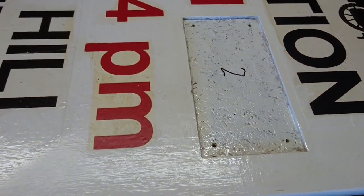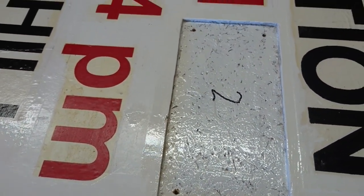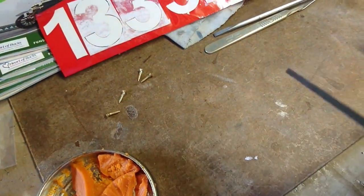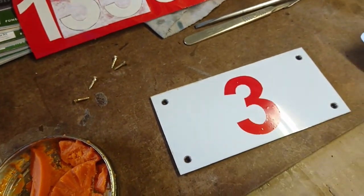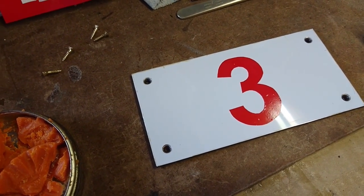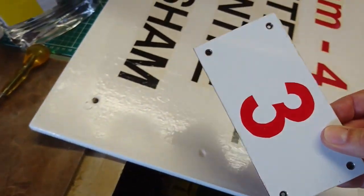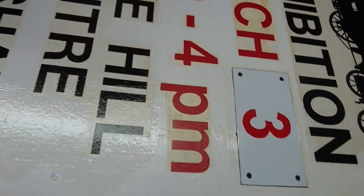I have routed out a little recess, well, quite a big recess, for these metal and rubber clad bits of signs, with black on the edge in the middle and aluminium on the outside with white paint. Put on the new date, so that can easily be removed next year without pulling off the paint from the wooden main sign, and replaced with ease. So that goes in the slot, recess, pocket, call it what you want, like that.